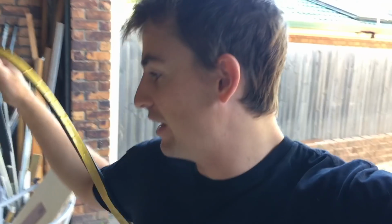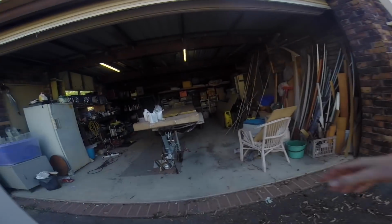My job today is to take out those 18 mil screws, epoxy the other side, and then tack them so they're right. And then once that's done, then sand them up, clean them up, and put them back in. So big job today, removing all the screws, epoxying, and then re-screwing. We just did that because we wouldn't have time to cut it all out in one day, and it was Hamish's tools we were using, so he had to go to work today. So that's what we're gonna do. We're about to get stuck into this.